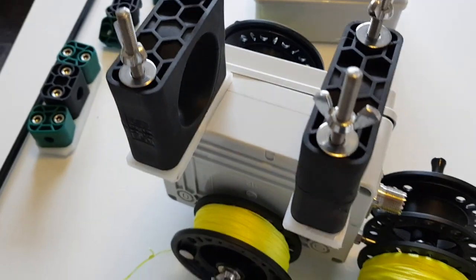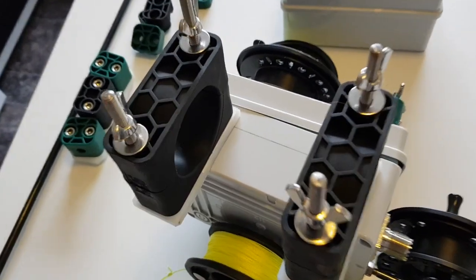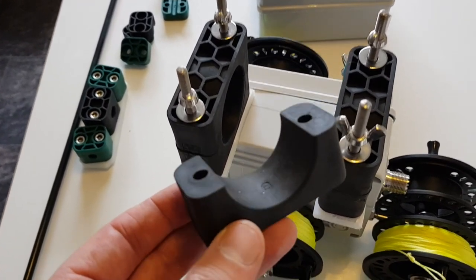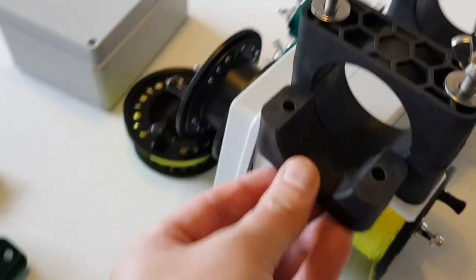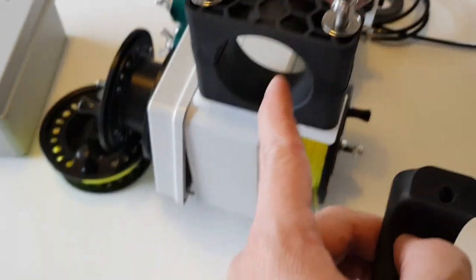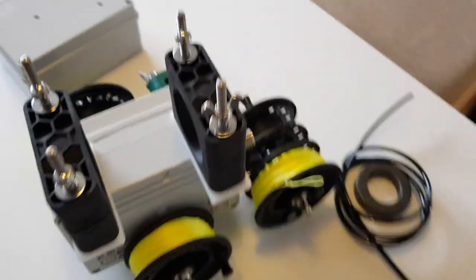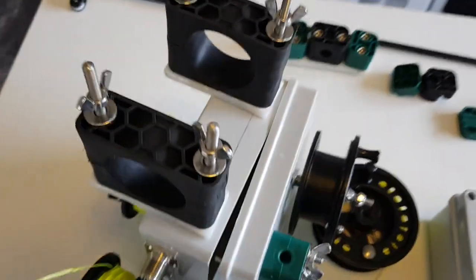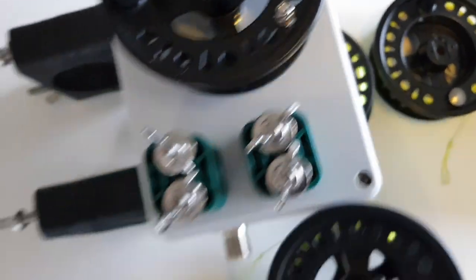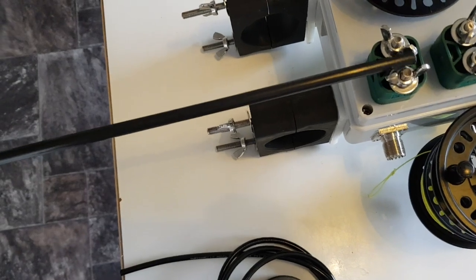I've designed these for Class 6 clamps, but they can also work with Class 5. If you have a smaller pole — aluminium or fiberglass — there's an extra set of drill holes so you can move the stud position and use different size clamps. There's a good variation from about 35mm up to about 60mm depending on your pole size. There's also a third 8mm fiberglass pole used here for your return rod.